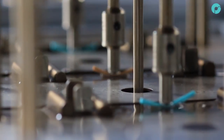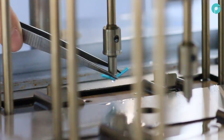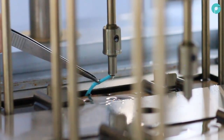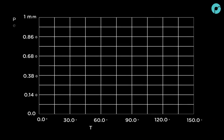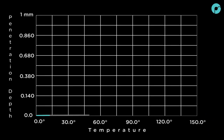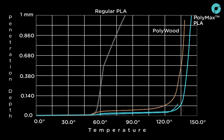Samples are submerged into the oil bath, which gently heats the filament samples. As a filament softens, 100 gram weights force the flat-ended needle down into the filaments, and the penetration depth is recorded by micrometer. Once the oil bath has run its temperature cycle, we raise the samples and analyze their penetration depth. This graph plots penetration depth versus temperature for our four filament samples.